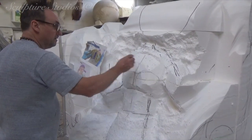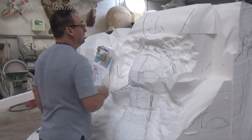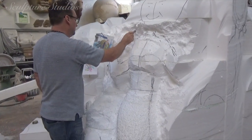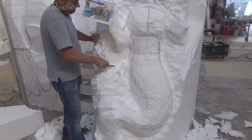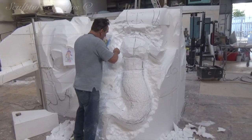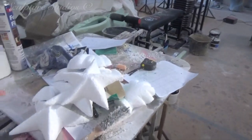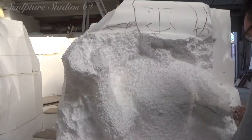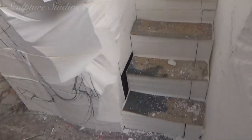This is the beginning stages of the mermaid. Rather than sitting on the rock with her arm being able to be grabbed and pulled off — providing an anchor point for children to climb up on top — she's going to be slightly more embedded in the rock. We're carving elements to add onto the main body of the shape so this can all be included before any glass fibre work begins. This means the client can see the complete master carving to approve it. This also allows us to laminate everything in one go, saving extra work later. There'll be no need to bolt through the fibreglass to add elements on, and it makes the whole thing more watertight as well.